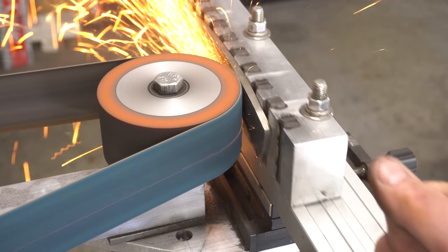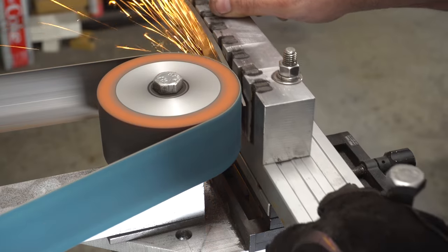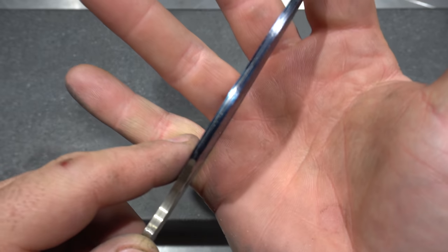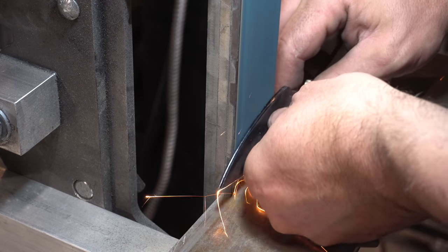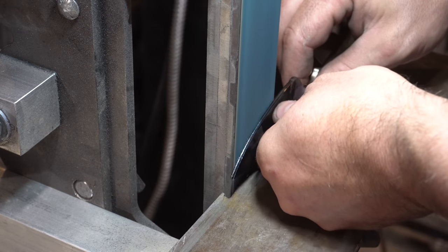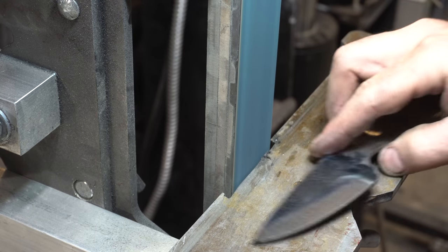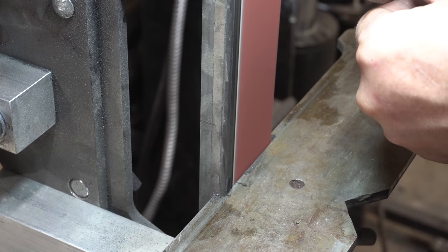Starting with 3/16th inch stock gives you a little more room to play with, so now it's actually a little thicker than I needed — time to go to the surface grinder and take it down. As always, use those layout lines to tell you where you need to grind to. First we're going to set that initial bevel and then bring that bevel up higher and higher until we have a great grind. Once I've set the initial bevel I switch to a brand new belt and grind the rest of the knife so I have a nice crisp grind line.